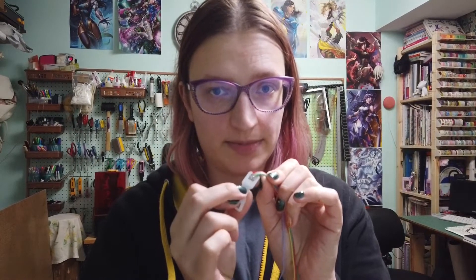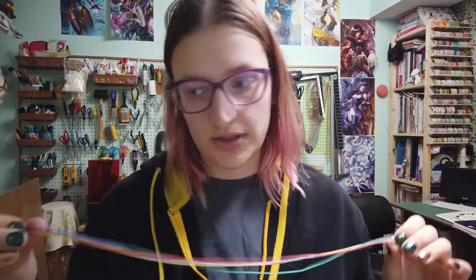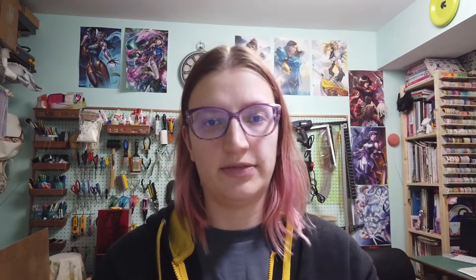To adjust the connectors, I don't want to re-solder the ends since that took so long and I risk damaging the well-connected tabs. Instead, I'm going to cut the wire in the middle and use heat shrink tubing and extra wire to twist and extend the wire, which should do the trick. I'm also going to hot glue the exposed solder points on the connector ends to protect them from moisture and prevent any short circuits.